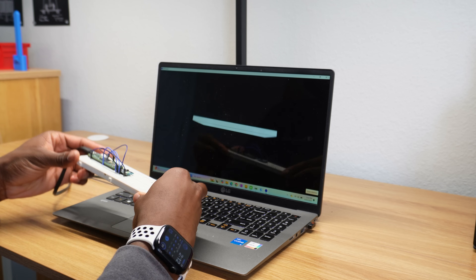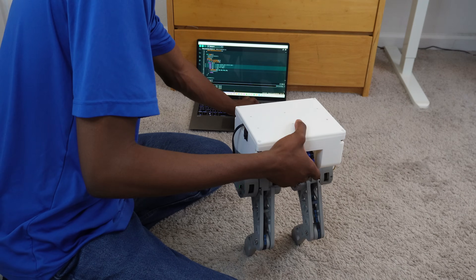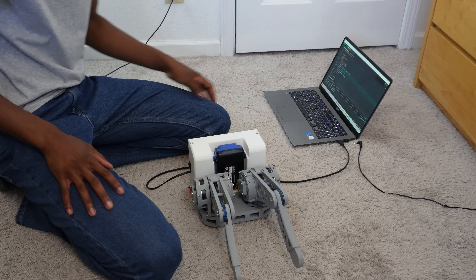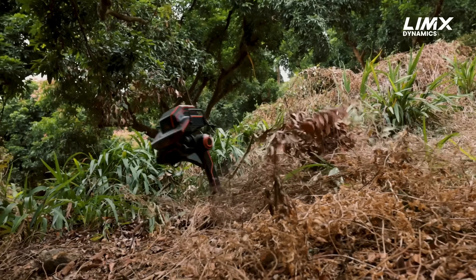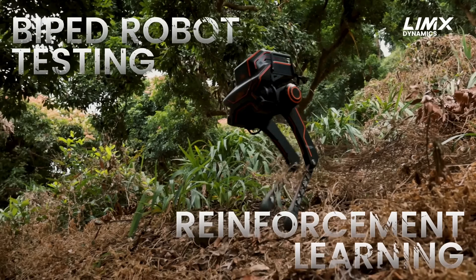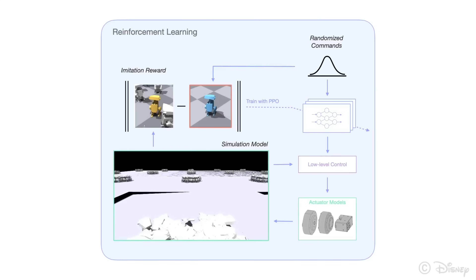In order for the robot to prevent itself from falling, it's going to need a way to measure its angle of tilt, which is where the IMU or inertial measurement unit comes in. After spending a couple of weeks programming a control algorithm to get the robot to balance, I realized I wasn't making any headway. The inspiration for this project employed a reinforcement learning policy to walk — in fact almost every walking robot uses some sort of fancy AI algorithm. I thought I could get away with a basic control algorithm, but that doesn't seem to be the case. So instead of spending another four months learning to implement AI, I'm going to slightly shift my angle and build a wheeled bipedal robot instead, which should be a lot simpler to control.